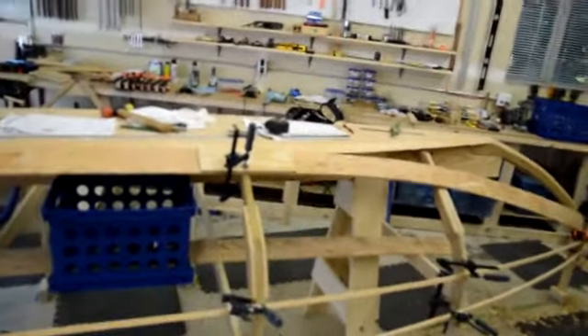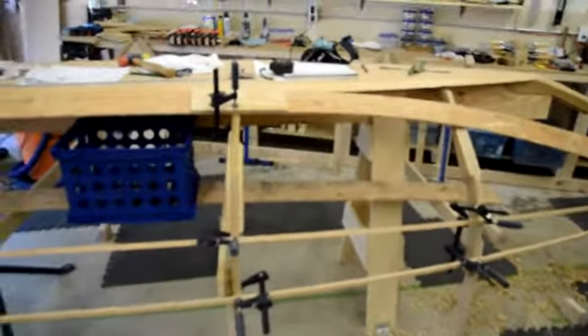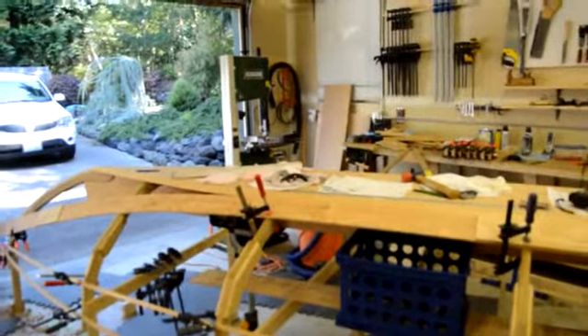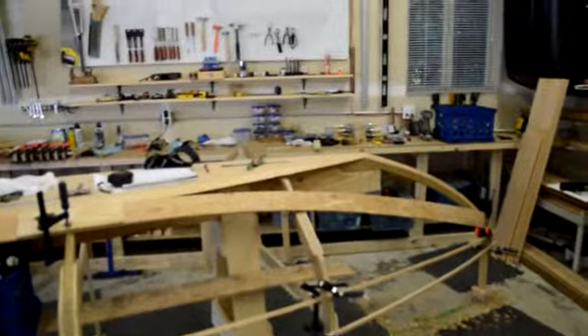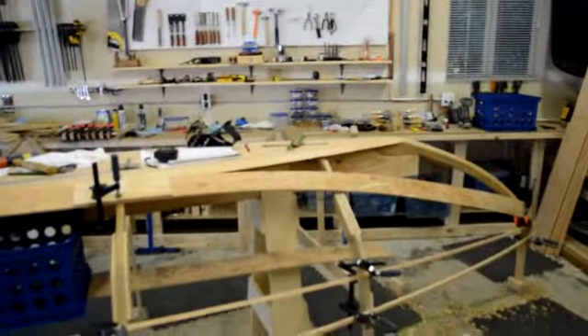Anyhow, that's where it's at at the moment. I'm still struggling with the sequence of cutting the pieces, fitting and laying them out at the necessary angles, and then doing the spiling work. This four-inch batten here will not work as a spiling batten — you can't get a batten to fit that kind of area. So I'm struggling with how to spile the garboard plank even as a three-piece scarfed garboard. I'm still trying to imagine how I'm going to spile it so I get a good layout, cut it, lay it down, and hope it matches up against the stems and seals up against the bottom fine. Anyhow, just small challenges — we'll get around to it sooner or later.